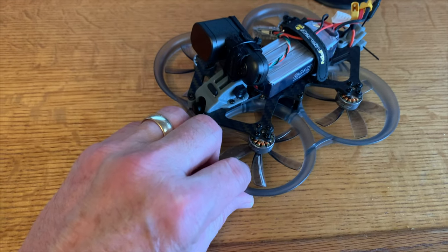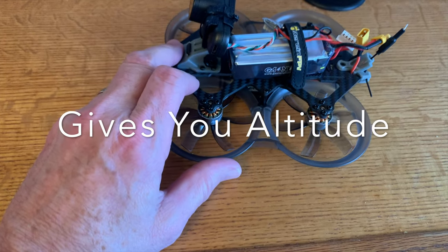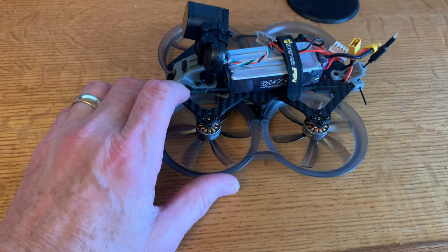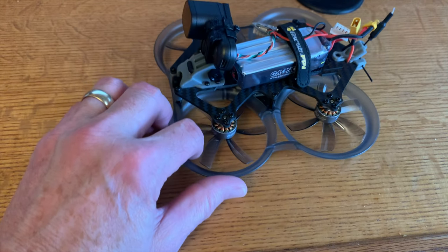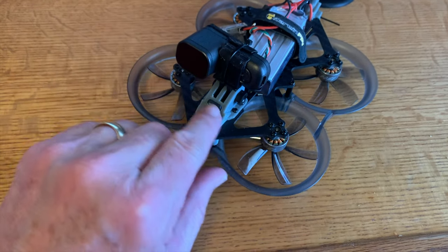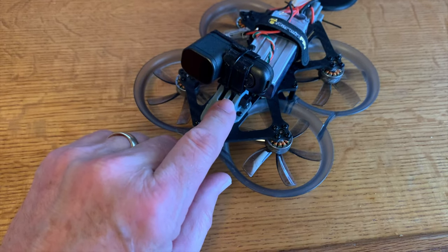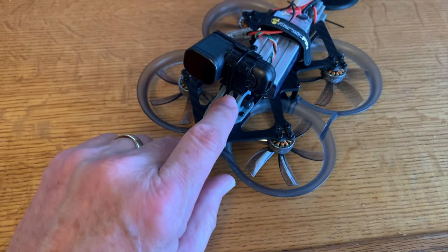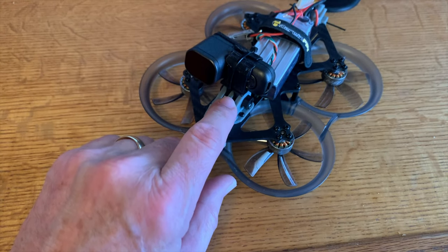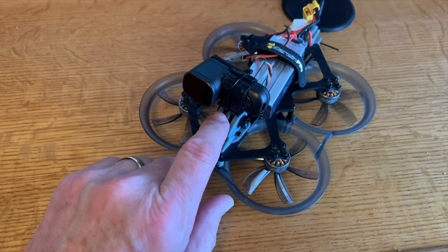on this. I like that the flight controller has a built-in barometer, and then the ESCs are rated at 30 amps, which is plenty for this CineWhoop. You can also, if you want to, mount a much larger camera. This is a kind of a standard GoPro mount here. So if you wanted to go with a GoPro session, you could do that. I probably would not use this for a Hero 11 unless you remove the battery to make it lighter.